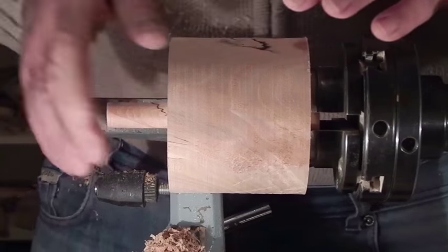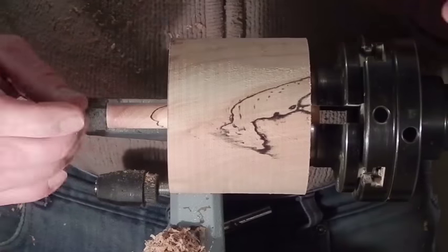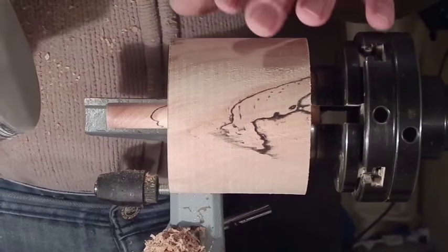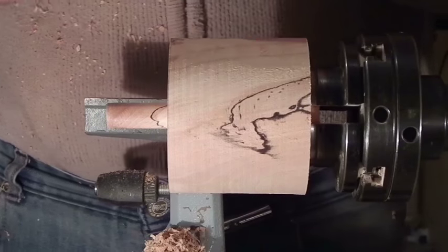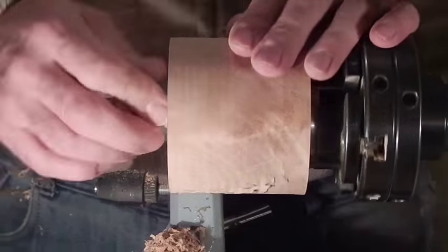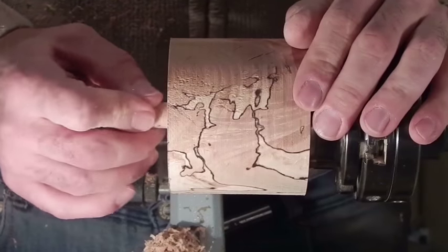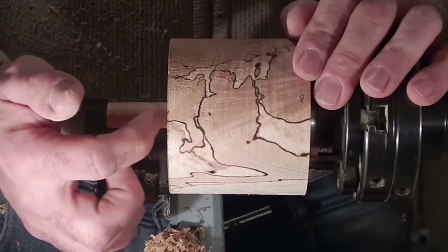Okay, perfect. So what I did there was I got it as close as I could for it being tight. And then obviously because these are plastic, friction's going to warm them up. So I just brought the peg in through the CDs so it's nice and tight. So I'm going to give this a sand right up to 1500 grit. Then I'm going to give it a finish so it's shining. I'm going to use a CA finish just on this peg, okay,